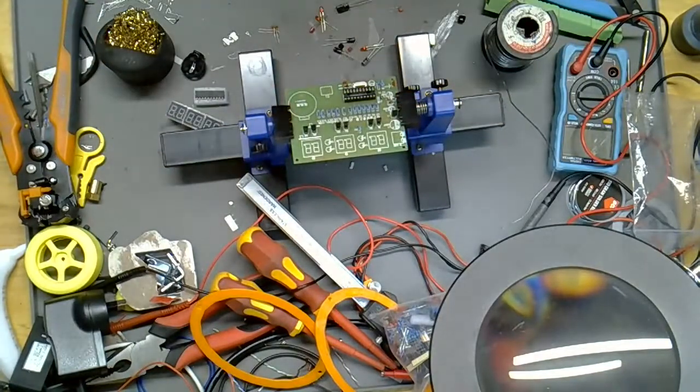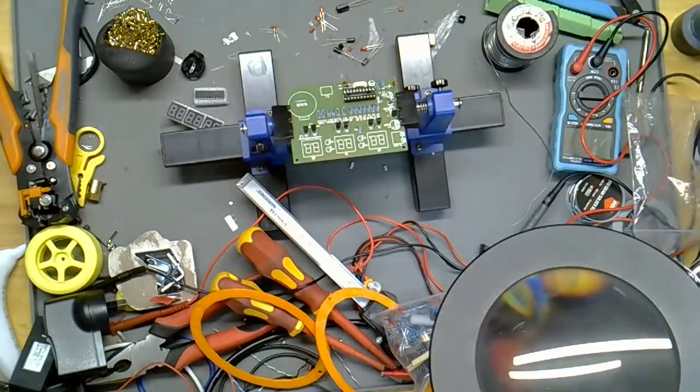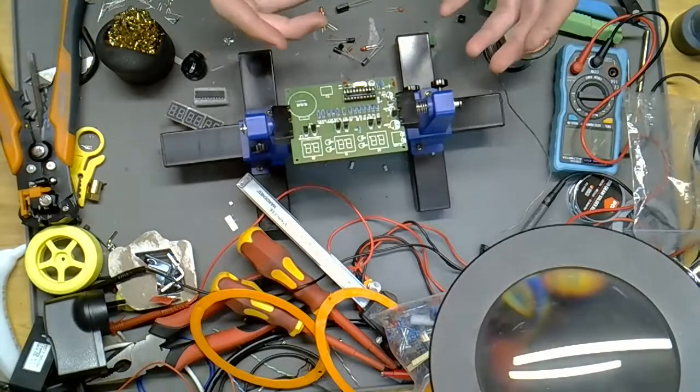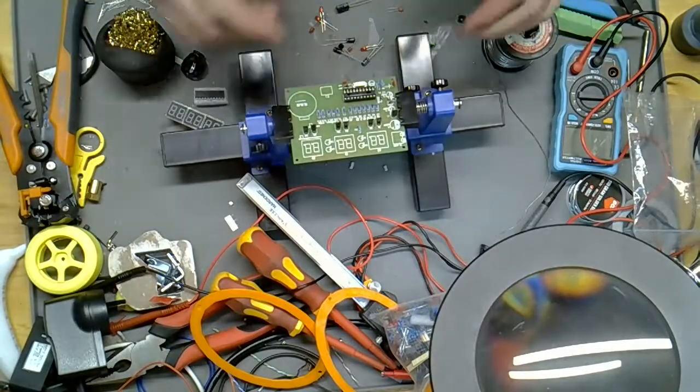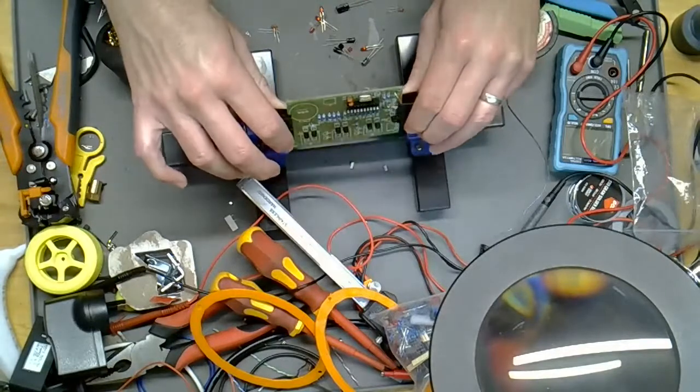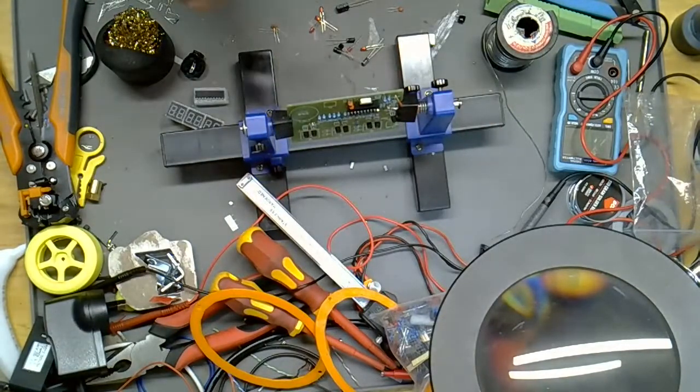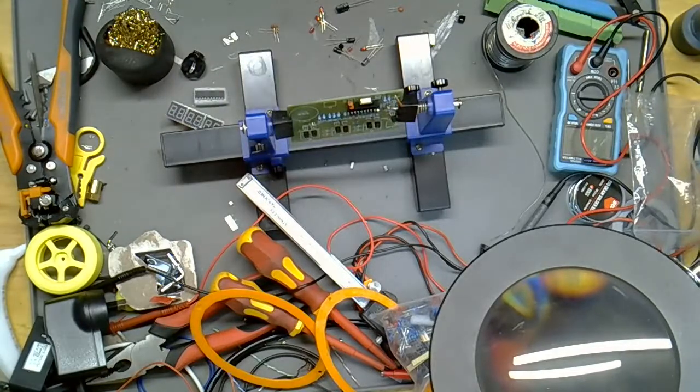Yeah, so if it's a 12 megahertz thing, I know on a computer motherboard, the crystal oscillator is usually double what the speed of the system is going to be. So if I want to upgrade my 286 to be 25 megahertz, I need to find a 50 megahertz crystal.